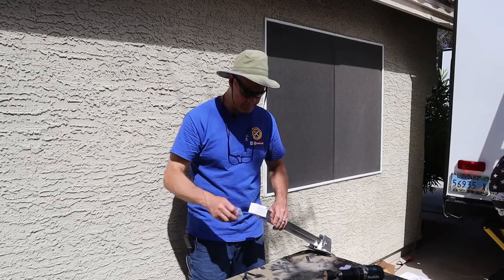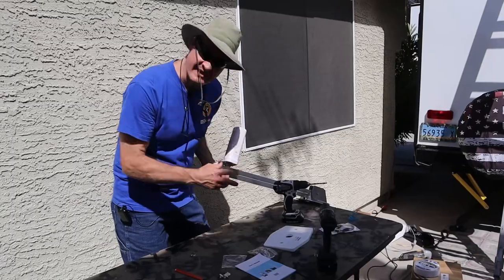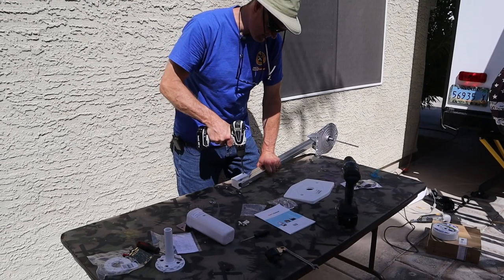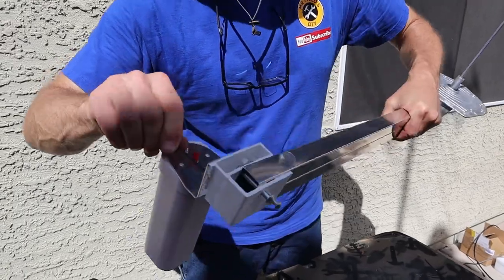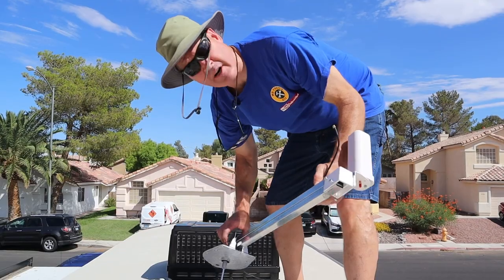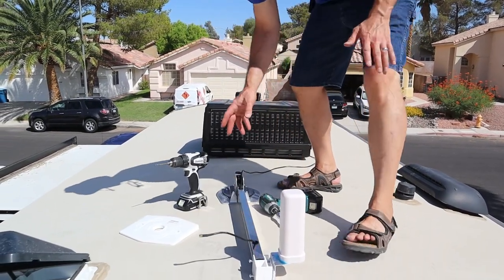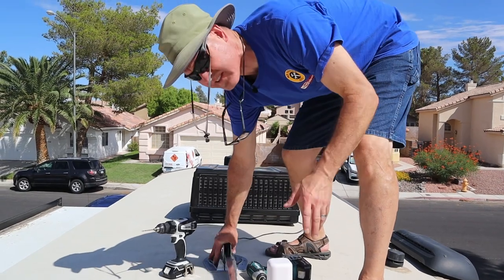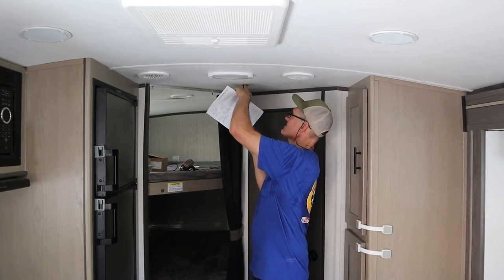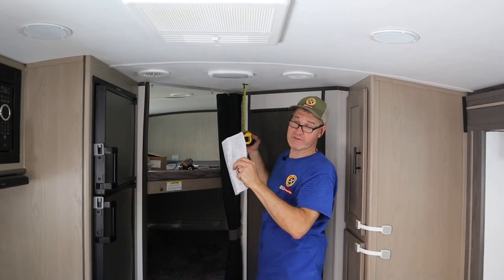Let's put these pins and clips in. Next, I'm going to drill two holes so I can mount the omnidirectional antenna to this mount. Those were the only bolts we had, but looks like they're perfect. For our test fitting, we're going to set this in the hole and drill two pilots, then attach this and go down and see how it fits. We know that our ceiling is four and three-quarters inches. The instructions say to measure down an inch and a half and cut off the shaft, so I'm going to make a mark and we're going to cut it off.